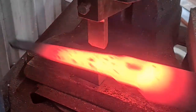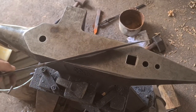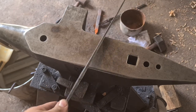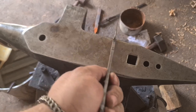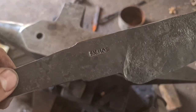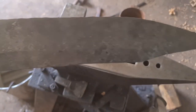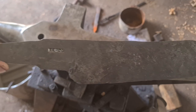And here — this is the last ride of Marty McFly for us; he's now been sold. You'll notice I did make a mistake, and the maker's mark is upside down because I didn't check. But there you have it — plunge cuts are nice and even, the edge thickness is down to 1/16th of an inch, about 1.5 to 2 millimeters. Everything's nice and straight. There's a little bit of truing up that needs to be done with files on the heel, and it wasn't perfect — there was a little bit of improvement to be made. But overall, not bad.